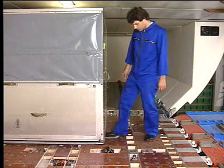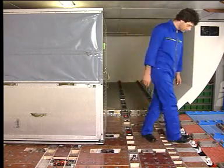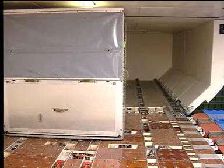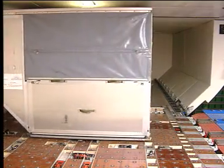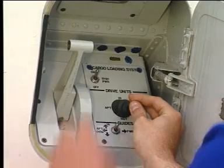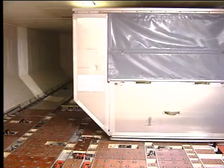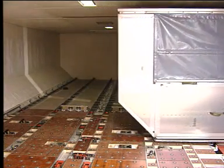Lower the two specific X guides in front of the container. Set the joystick to the out position. The lateral movement starts. Move the sill lock handle down. The overridable door sill latches are lowered. The container leaves the cargo compartment.